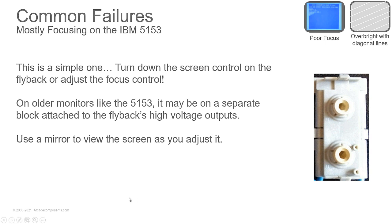Is that pretty much a guaranteed thing with CRTs that all the voltages are going to come out of the horizontal output? Yeah. Okay. That's one way to boost efficiency and lower power wasting. You know, they're going to derive it off of that. It's also cheaper than going in and putting in a really fancy power supply to give you all these different voltages.